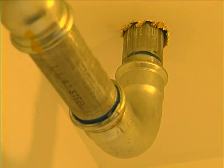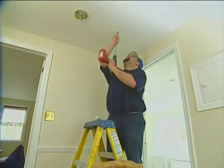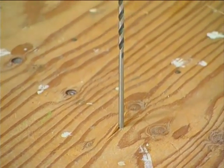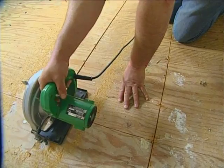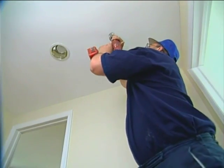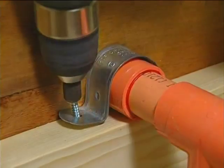The final section of metal pipe is passed through the ceiling and into the attic. Here, the pipe is run horizontally above the bedroom ceilings. Once we got out into the attic, we had some floorboards that we had to deal with, but it was attic flooring, and it was something that we could cut channels out and actually reinstall some of the attic floorboards once we were completed. So you almost didn't even know we were there at the end. But the attic allows us to do a lot of our piping. Even if we have to expose it, we know we're going to insulate it later on. And that allows us to pipe all the heads down to the second floor ceiling.